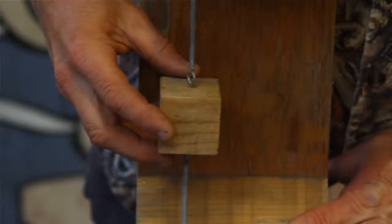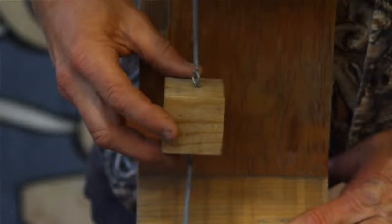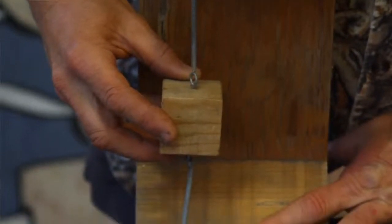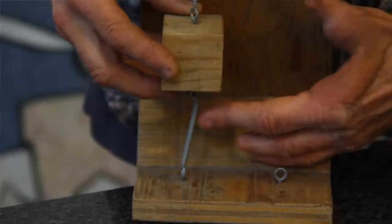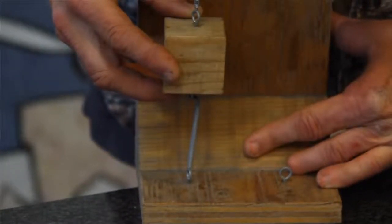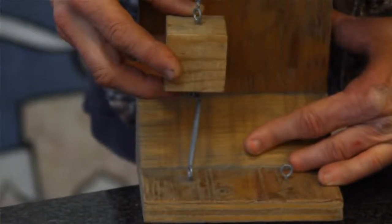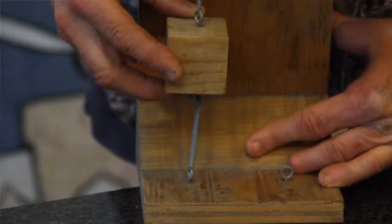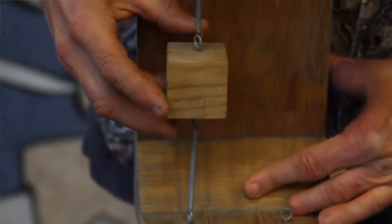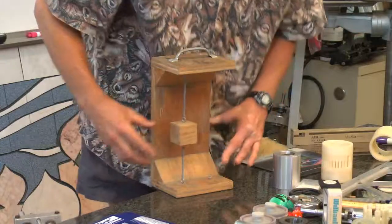So when I move up and down, I feel how stiff this is. If I move such that the lower spring is now loose, I'm applying a steady force to move the spring, but if I apply a little increment of force, I get a lot softer response. Here, when I apply the same force, I get less motion.